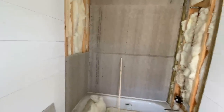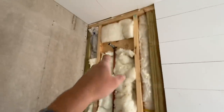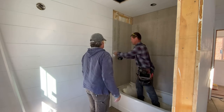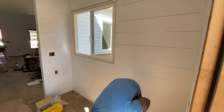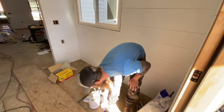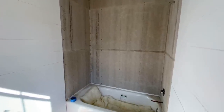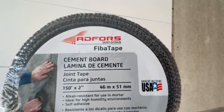I got the back wall installed and I'm going up the sidewalls, leaving the hardest part for last — which isn't really that hard, you just have to drill two holes for the plumbing, and up top there's the spout hole. There you have it, one shower wall done with backer board. It's ready for fiberglass tape and a little bit of mortar on the tape, then it'll get a couple coats of water sealing membrane, and it's ready for tile.